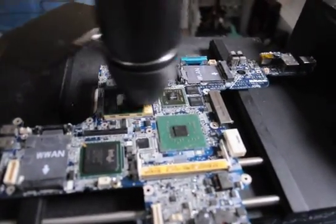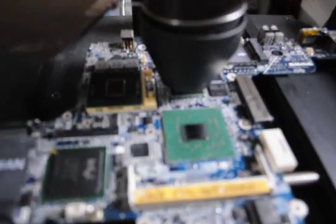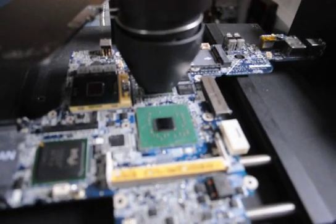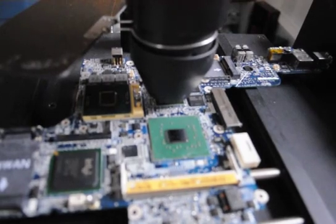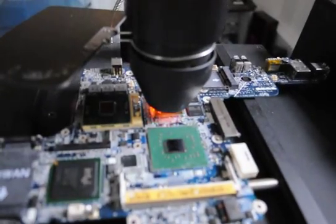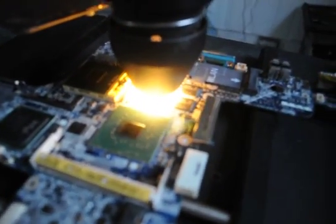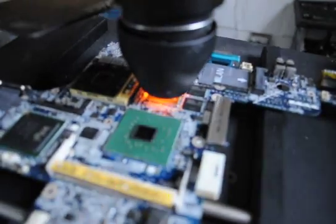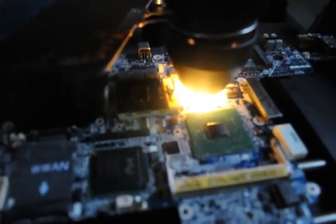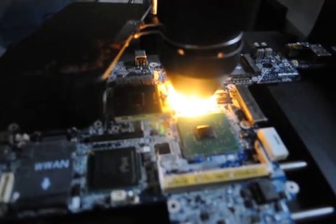What's going to happen is we're going to swing this arm over and check everything to see how it is. Pretty much the same setup as the DV NVIDIA systems or the ATI chipsets on the other systems. No special time is needed for the actual reflow — you can use the same time as you do with the DVs. That's explained in the DV4 video, which goes through temperature profiles and actual reflowing.